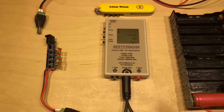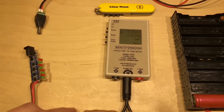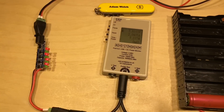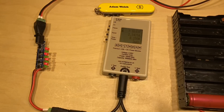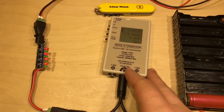This lithium-ion cell on the right is an 18650, fairly well discharged at 3.3 volts. So let's get it plugged in. Red is charging and green is complete. As we would expect, we've got four red LEDs — all the ICs are charging this battery, and in fact we're delivering 2.14 amps into it.